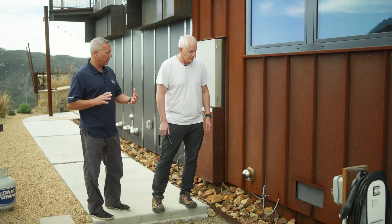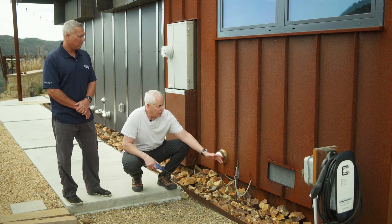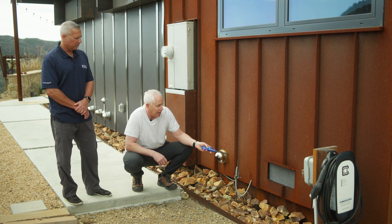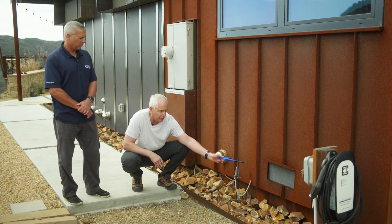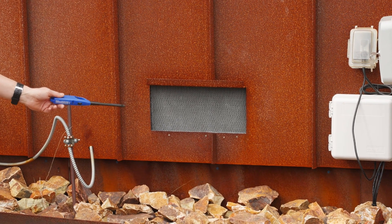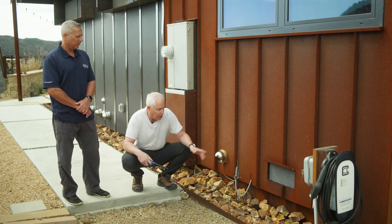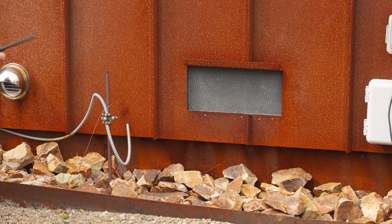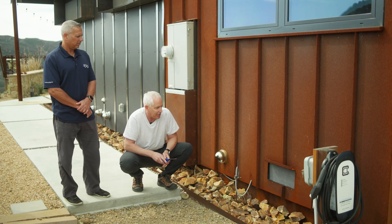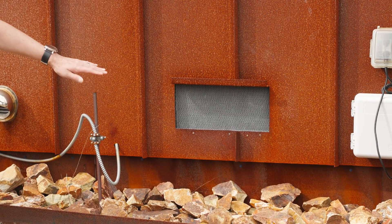You talked about retrofits and things you can do to keep embers from getting inside — here's a perfect example of a screen. This is a screen going into the crawl space underneath the first floor. The screen is a metal material sprayed with a chemical so that if you put heat or a blowtorch on it, the chemical starts fizzing and literally closes up the air gaps in the screen. These are going to be standard requirement very soon for any place one of these screens would go — either for a crawl space or an attic space.